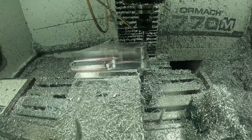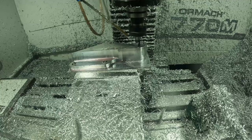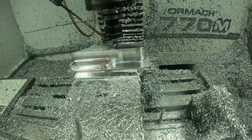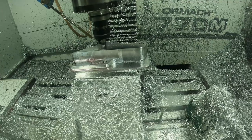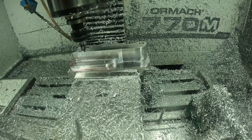Don't like sharp edges. If I can, I'll add radiuses anywhere I can, corner rounder, chamfers, anything, just to keep stuff not sharp. I also needed to chamfer the holes, and especially the bottom holes, since those are getting thread milled here in this next toolpath.